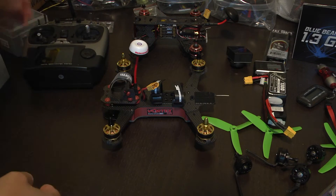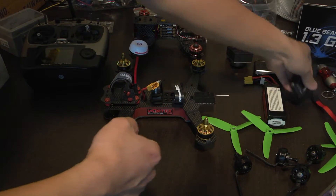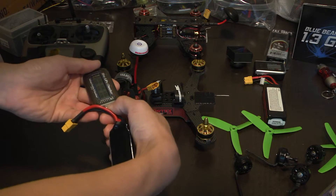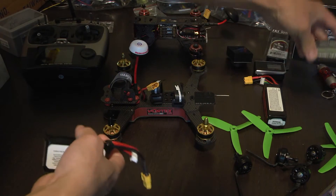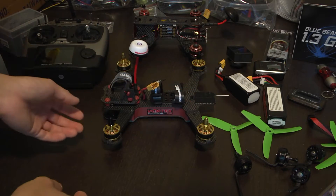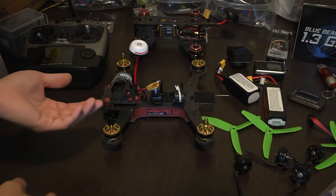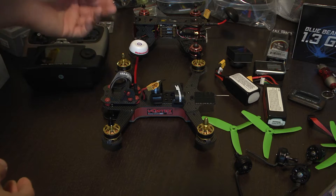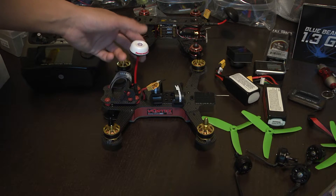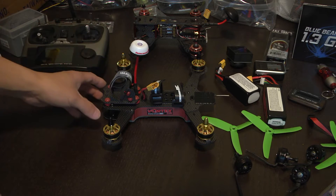RotorSense is pretty convenient. Before we test this out, let me check the voltage of this battery first — yeah, this is good. Make sure that you remove all propellers from your quadcopter as a safety precaution. Also, most importantly, make sure that your video transmitter antenna is on, as you risk burning out the transmitter when you power on without an antenna.